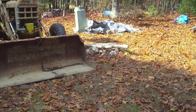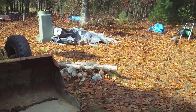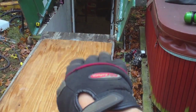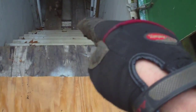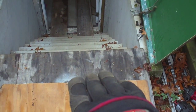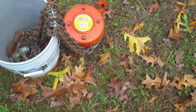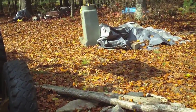I've got my rig already set up with my strap. First thing I've got to do is turn it around because right now it's facing the wrong way — I need the back facing outside the stairwell, so as the bottom kicks out it will want to lay on its back and slide down. My chain fall is only rated for one ton, approximately 2,000 pounds, and we don't know the exact weight on the base.